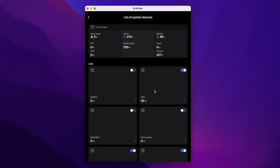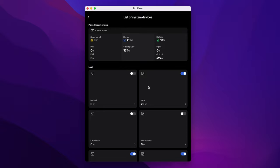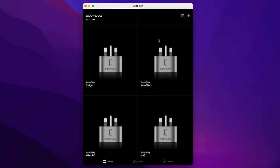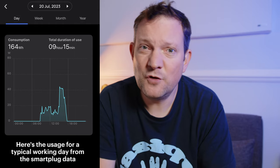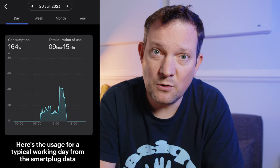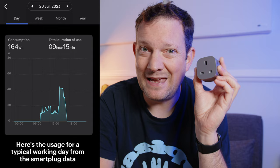I've currently got seven of these fitted to various devices throughout the house. For example, I have one upstairs that my partner uses for all her work equipment — her laptop, the light she uses on video calls, and her headset charger. The amount of power that needs is constantly changing. It can range from zero when she's not working to about 15 watts minimum, but on a call with a light on it can go up to 45–50 watts, varying with processor usage. That's plugged into one of these, which means none of the power for her work comes from the grid — it all comes from solar, and it adapts based on this smart plug.